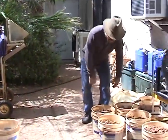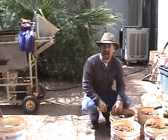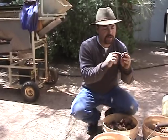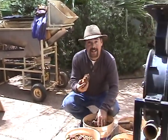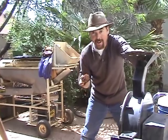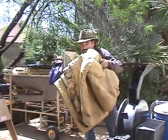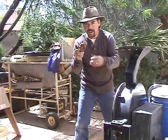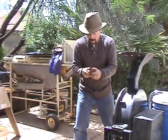Wow, that is heavy. We went ahead and collected five buckets of material out of that seam of iron oxide. As you can see, it's pretty brittle — it's mostly clay and iron mixed together. But the gold is trapped in these little seams right here. It's kind of hard to run something like this through a dry washer as-is, so we're going to run it through this impact grinder, which is going to take this and turn it into about 200 mesh powder. Before we do that, we need to lay it all out on a tarp, because there's still moisture locked up in it and it won't grind well if it's wet. We'll let it sit out for about a day, maybe two, then break it up by hand so it'll fit inside the feeder tube, grind it all up, and get the gold out. Hopefully there is some in there!